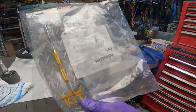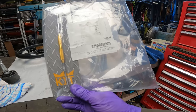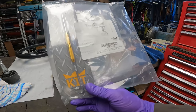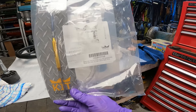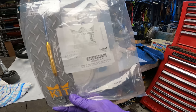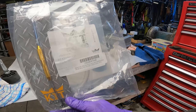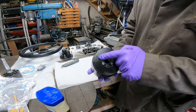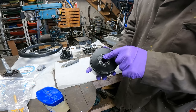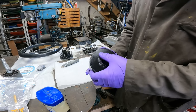This is the aftermarket seal kit I bought off Amazon — as you can see it's for this particular pump and it comes with all the actual tools to do the fitting as well. As of 2023 I think it was about 56 quid. First of the new seals is in. Remember this cover here is only plastic, so when you tighten these screws, just finger tight, otherwise it'll distort the plastic and potentially crack it.